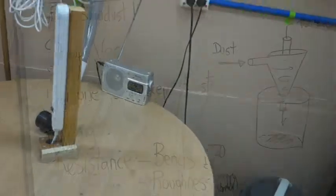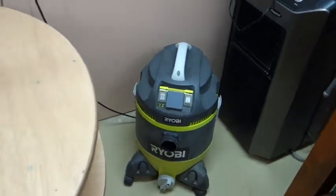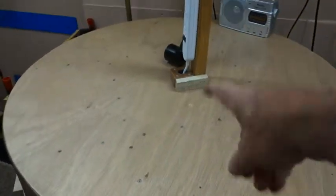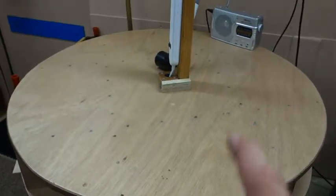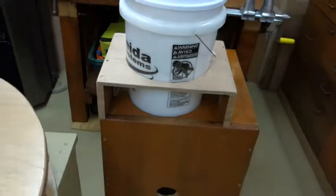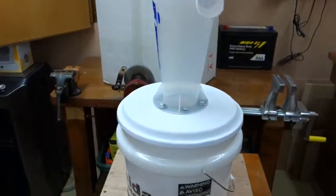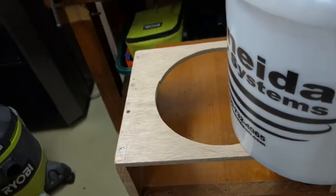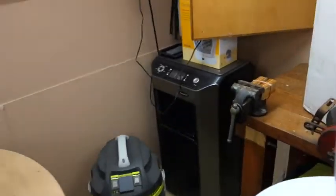So I'm about to start doing that. There's my shop vac — it's a Ryobi shop vac, just a standard little one. I've already begun — some of you may remember from my other vlogs — this is the rotating tool station which will have a drill press and a saw and whatnot. I needed to set up the dust collection system before I set up the tools on here. The idea is: the shop vac is there and here I've built a wooden structure — it's very noisy — with the cyclone on top of its collection bin. The collection bin sits in this little holder so you can take it off or put it on whenever you want to empty it.